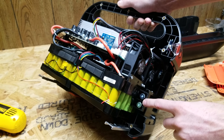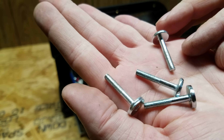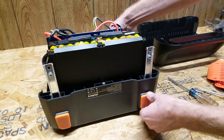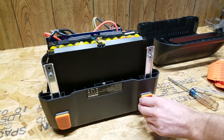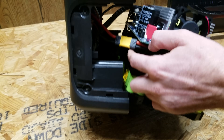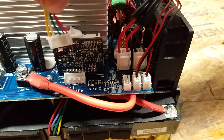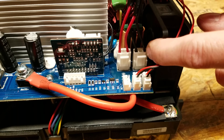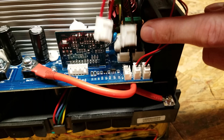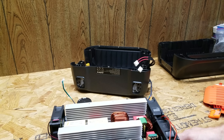Next I see there are two large bolts here which appear to be holding in this battery pack and inverter module, so we'll remove these next. Those bolts are all the same size but interestingly have very fine threads. With those screws out, let's see if we can separate this. There is an XT60 here — we'll disconnect that first. And then here we have a five-pin connector which goes to the front board. This is the AC output going to the three receptacles on the front. It's important not to mix these up because they are not color coded correctly — the red lead is going to the line and the black lead is going to the neutral.